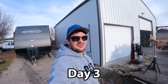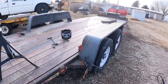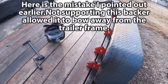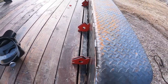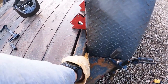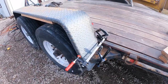It's a new day. Sun's going down again. I have about an hour and a half of sunlight so I've got to hurry. I got this up in the dark last night — you couldn't see very well. It's not the best fit-up; there's a little bit of gap. I'm going to tack it in place. There's a decent bow there, so I'm going to weld the two ends and then pull that side in tight to get rid of that gap. I can't do much pulling until we're solid, so I'll weld down here, probably squeeze this in with the clamp, weld down there, then get the same on this side. This side's a better fit-up, and then we'll get it pulled tight.